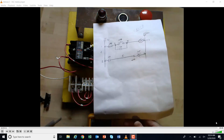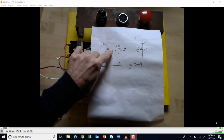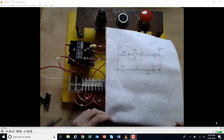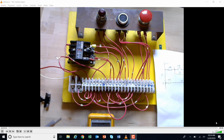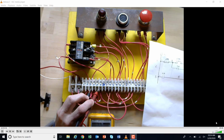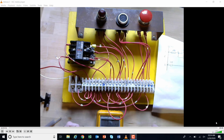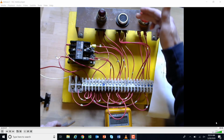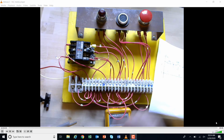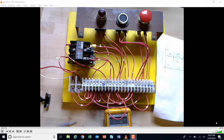So as I troubleshoot here, I want you to understand how this is set up. These have wire numbers on them, 1, 3, 4, 2, that makes sense. And this is marked right here, and that corresponds to the wire numbers that are on here. So I can make my readings here, okay? Unlike the last circuit, I'm not going to check for any voltage, because we have voltage because the light and the relay are working. So there's going to be something else, like a contact problem or something like that. There's something else wrong with the logic here because the devices do have voltage.